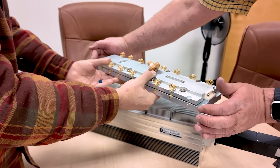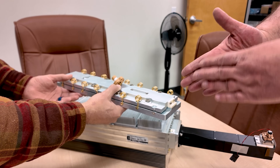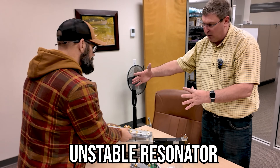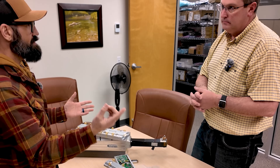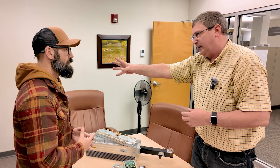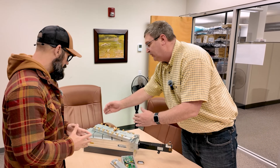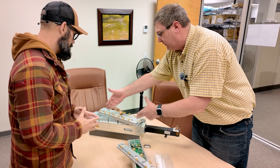On the outside of the tube, there are two mirrors which reflect the light back and forth, and then one edge of one mirror lets some light out. This technology is called an unstable resonator — it allows you to build high power in a small package. Every pass through the cavity, it picks up a little more power until it gets to the end and leaks out at 120 watts. It's called unstable because the beam continually walks from the center of the bore on either side until it exits.